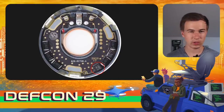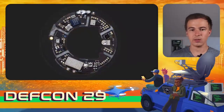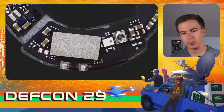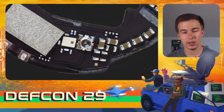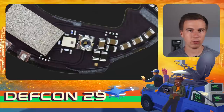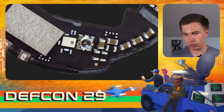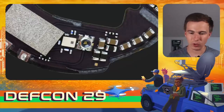If you remove the PCB — which is annoying because it's glued tightly — you get to see the interesting side where all the integrated circuits and controllers are. The big silver chip is the Apple U1 chip, the ultra-wideband chip, with a nice antenna connector next to it. What's interesting about the U1 is that so far it was only available in expensive devices like the iPhone or Apple Watch — not in a price range where you can buy ten, desolder the U1, and experiment. But now with the AirTags, we have a U1 available for around 30 or 40 bucks, and I think we'll see a lot of ultra-wideband research come from this.